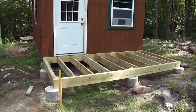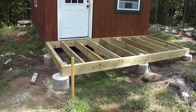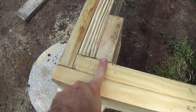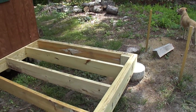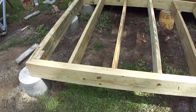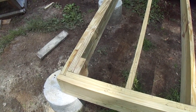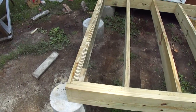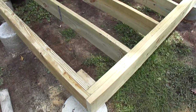The floor of the porch is now totally framed in position and secured to the cabin. So in the corners here, I doubled it up with some blocks, and in the center, because eventually this is going to have a roof and I'll use 4x4 or 6x6 beams. Putting those blocks under there will just give it added support. I also doubled up the boards on the perimeters, something I wish I had thought to do when I initially built the cabin, but at least I'm doing it now.